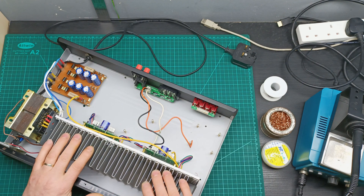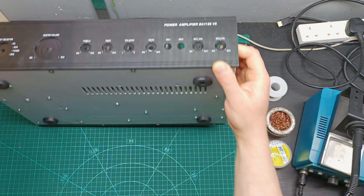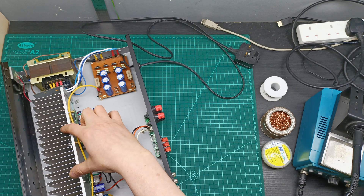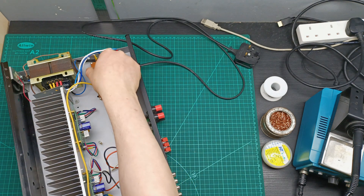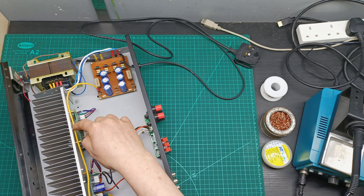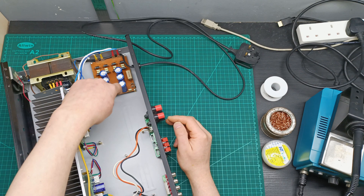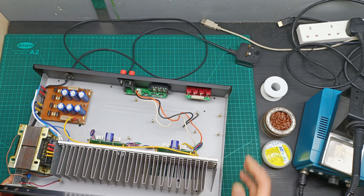I also mounted the heat sink in place — you can see here I have holes so that air can pass through in order to keep it cool. I also mounted the amplifier boards on the heat sink with standoffs, so I have easy access for mounting the wires. I already started mounting the positive from this board because I have this rectifier board for one amplifier and this rectifier board for this amplifier. Now I still need to carry on connecting all the output wires for the speakers and do all the wiring for the power supply to bring to the board.